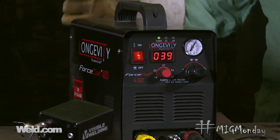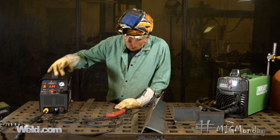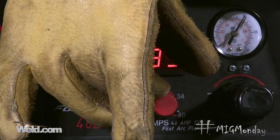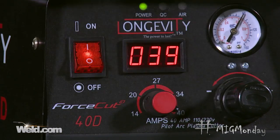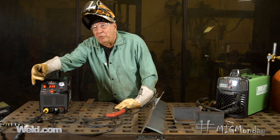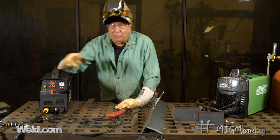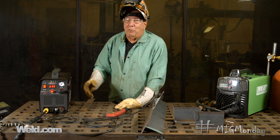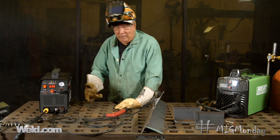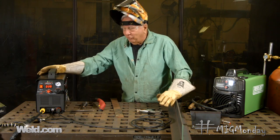It's very simple to set up. All you need is an air hose connected to a compressor, dial in the proper setting on the air pressure, and then you've got a control for the amperage. On thinner material you can set it down to a lesser number. I have it up near the top because I cut a bunch of different thicknesses, so rather than run back to the machine all the time to adjust it, I pretty much have it maxed out all the time and just make my cuts.